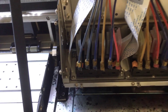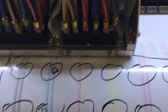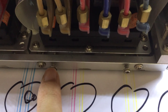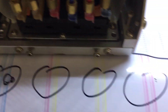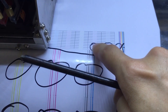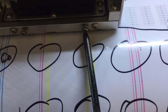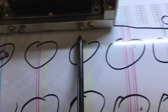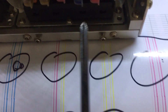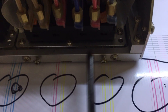Let me move the print head. There are four screws: one, two, three, four. According to the vertical plane and horizontal plane head status, first we loosen these two screws. These two screws are for pushing the print head.